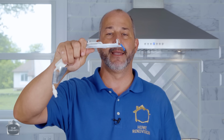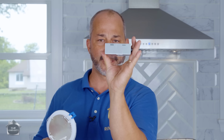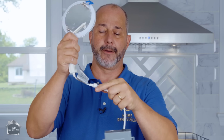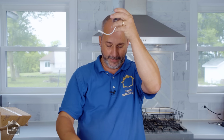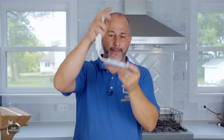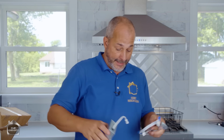This can be installed in the drywall, and all you need in addition to this is enough space to slide this box, okay? They connect together here like so. So if you're in a basement, for instance, we'll just pick on basements for a little bit, and you have your hot air and your cold air line, there's usually a gap in between the two. You can actually wire this box, slide it in between the gap, okay? And when you're done, you can cut your hole, connect your line, and then snap in the fixture with only a half inch of space between the ducts and the drywall. That is a brilliant way to keep the height in your basement and make it feel more like a normal room without having to make big bulkheads, which we used to have to do if we wanted to have lights in those areas. So you got options now.